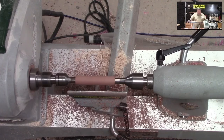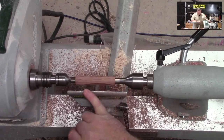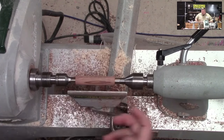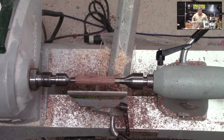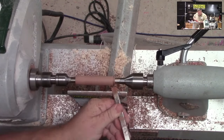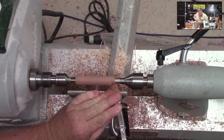The blank I chose for this is a rosewood, and you can see it's got some really cool grain. It's kind of reddish with some brown streaks — there's some light pinks and purples in there, with really dark lines and really light lines. What I like about this wood is you get very good contrast in color, and when we put finish on this it should look really good. I'm going to taper these ends to the bushings and give them a little bit of a bevel.